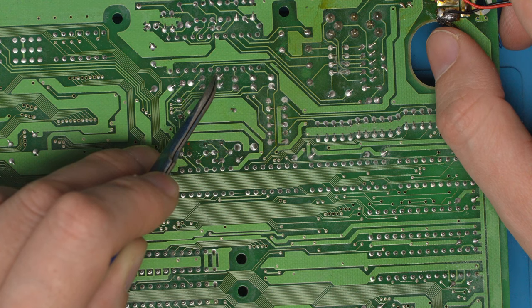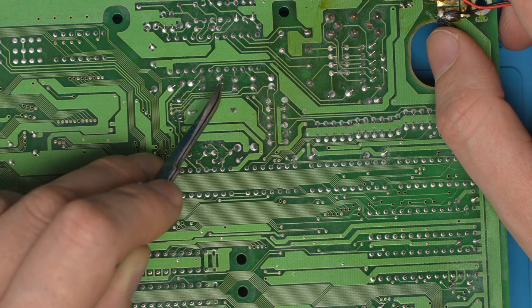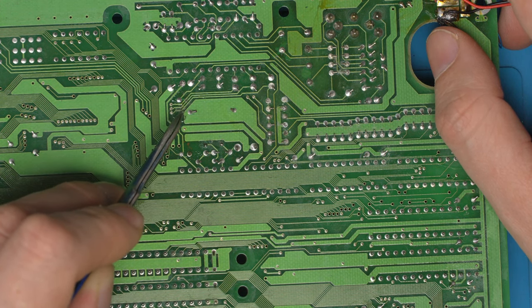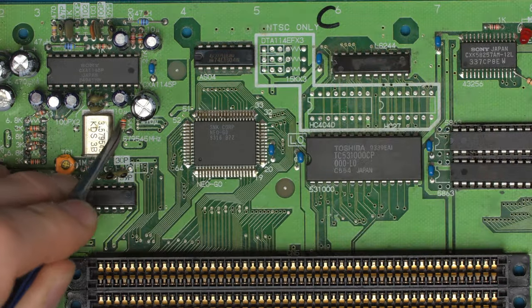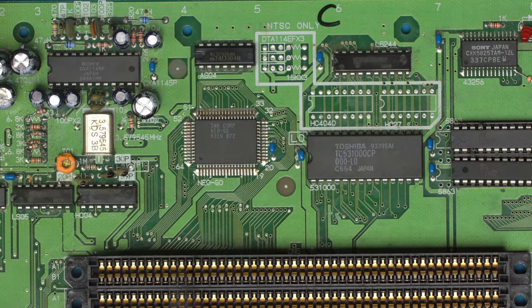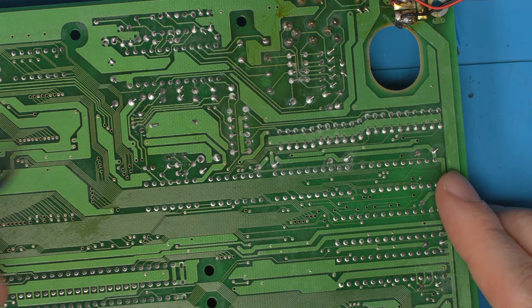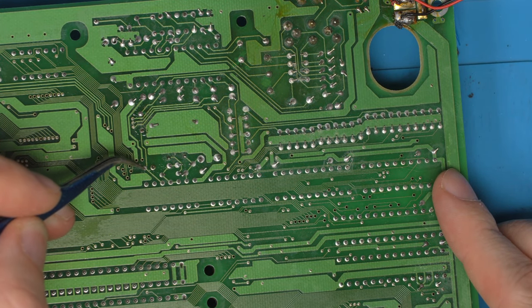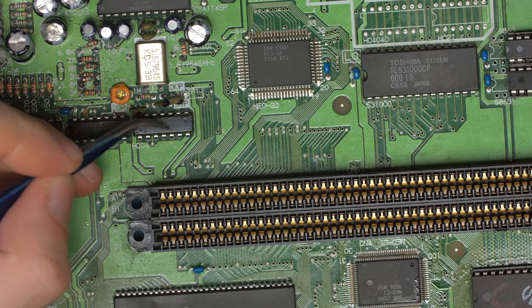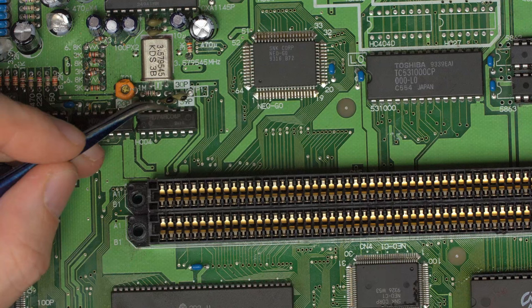So this one specifically is the input, so the stronger signal goes through a capacitor. And then if this is a resistor on the other side, which I think it is, yeah, it's a 3K resistor here, and then it carries on somewhere. We could check the schematic for this, but it's not that important. Looks like it passes over here, down, and comes out of the third pin of this chip here. So third pin on the right, and that's this pin here.